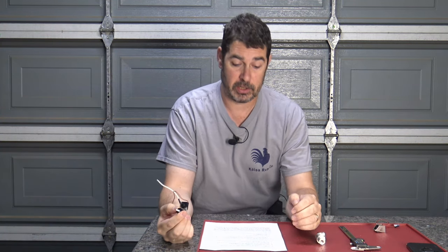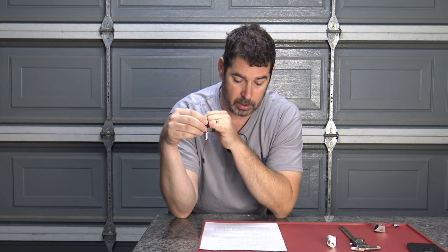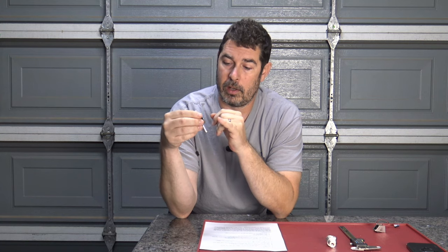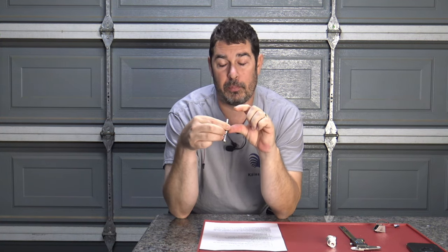METAFORM does have some changes and improvements, and I'm going off my cheat sheet here that they sent me, that is going to improve on what the original design intention is. For one, they're adapting the original mounting collet that does come with it to match up to the E3D style, J-head style collet, which means it's compatible with more printers. Because the way that this attaches is removable, and because you can print your own, you can adapt this to any printer, including printing a longer one if you needed to be able to drop it down to match the height of something. Let's say you're trying to match it to a CR10 or something else.